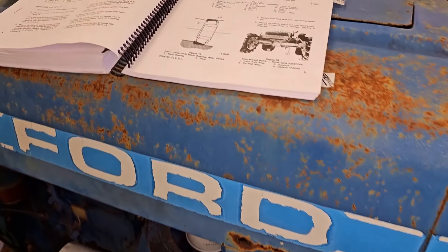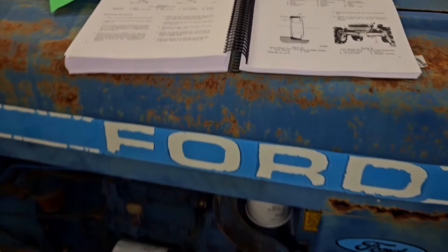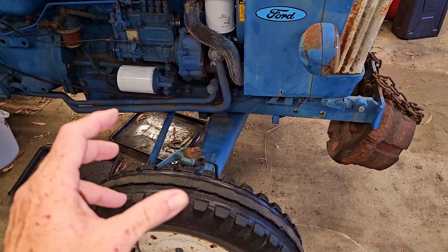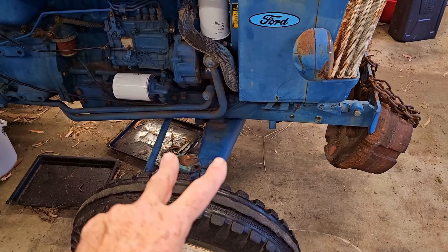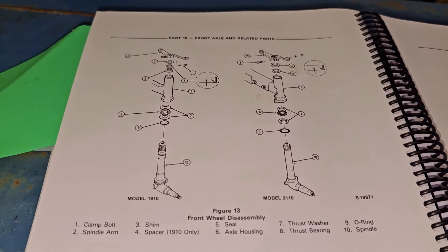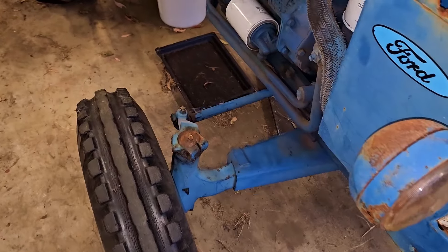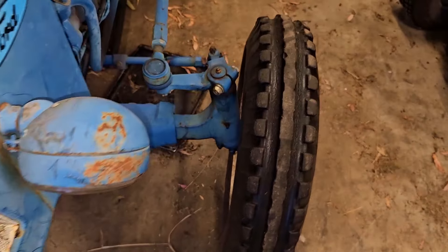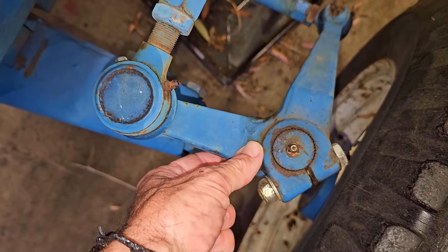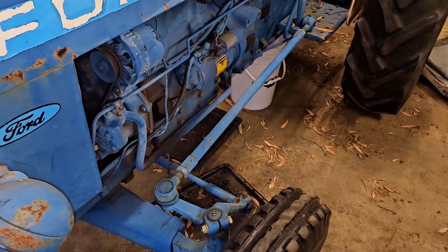Trying to get parts for this is a real trouble at the moment because the guys at the local tractor warehouse said not only could this be a British variant, but it may have been cannibalized from different parts. It's a bit of a mongrel — it's been cannibalized from a 1910 because those parts can fit on some 2110 assemblies. They're saying that's probably what's happened because the parts are very hard to get. Spindles are okay to get, but anything that's forged or fabricated is a little bit harder to get. We can still get the steering arms. This assembly over here, Bianca and I were looking at today — that is welded on, it should be cast. So this is another reason why we think it may be a bit of a mongrel. They've had to put a different angle on there to take the existing steering arm they had.